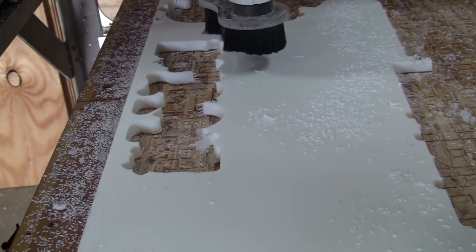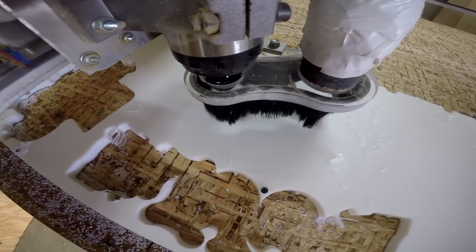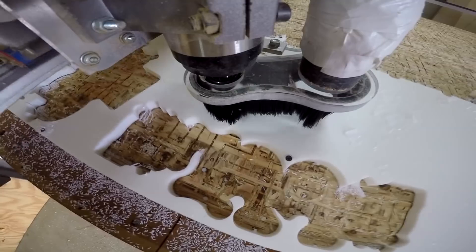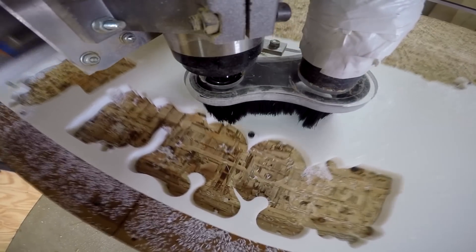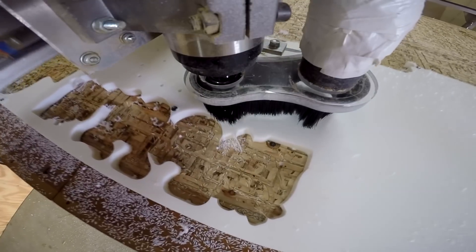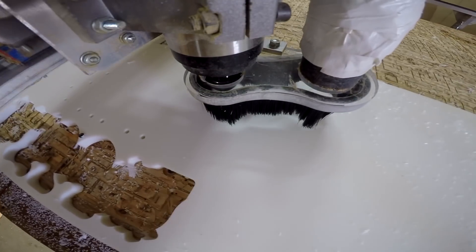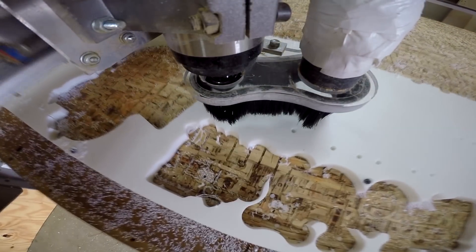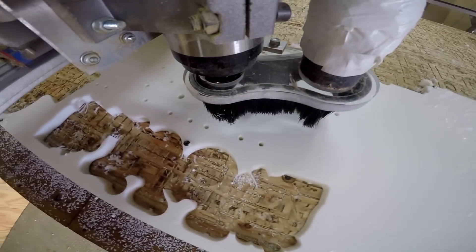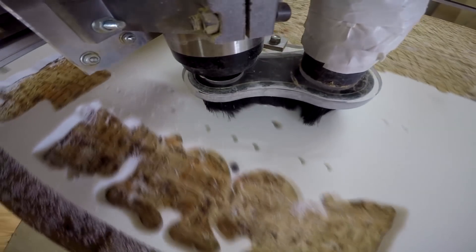The other thing that happened on the first file: you have your roughing pass and then your finishing pass. On one of the parts, the roughing pass went up to a point, but the finishing pass had to cut more material because of the profile of the part. The little bracket that holds the outside of the tube looks like a zigzag. The roughing pass wouldn't go inside those little gaps, but the finishing pass goes into them. If you have holding tabs and the finishing pass becomes too aggressive, it takes more material than you'd expect because of the dimensions of the part and the size of the end mill.